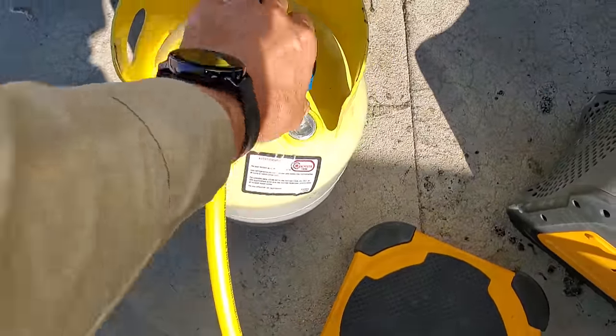Something I wanted to point out, I don't think I addressed this in the last video. You notice that my Measure Quick target is a lot higher, and you notice that we're maintaining it, and all the stages were doing that last time. Because we're using pressure limiting expansion valves, it doesn't let the system pressure get any higher. That's why Measure Quick's target is so much higher: we're pulling a lot of outdoor air, but the expansion valve is actually limiting the pressure.